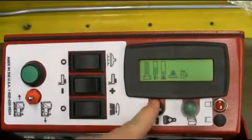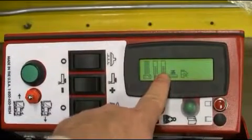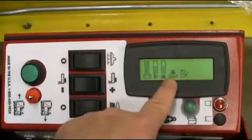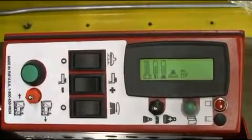Note, make sure that the pad drivers or scrub brushes are properly installed before lowering your scrub deck. Just above these switches is the black toggle brush pressure switch. This switch allows you to adjust your brush pressure based on the needs of your cleaning application. Note, always start on low brush pressure setting before increasing your brush pressure.